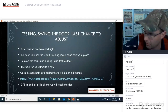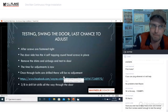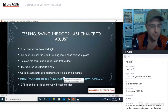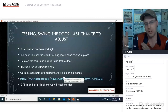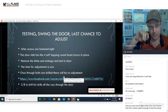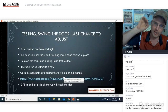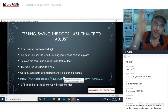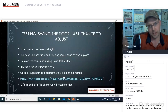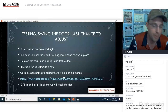Address a couple more comments and things here with double doors. It depends on what doors you have, but a lot of doors are going to have an adjustment in the weather stripping on the edge of the door. So you can adjust that out. Even though you see a gap there, once we loosen that and allow that to spring out, if you've ever seen one of those doors that has all those springs, either round springs or those big pieces of metal that look like a spring that are cupped this way, those actually are specifically designed to be adjustable on one side, if not both sides.